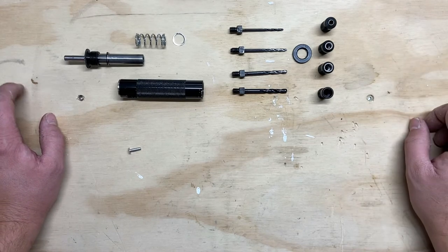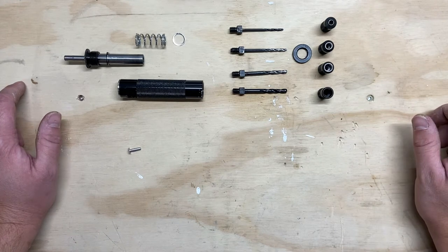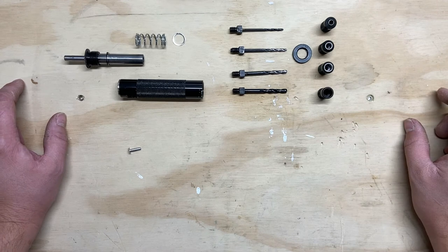What this tool does is it helps prevent damage to rivet holes in the metal around it. The tool will help accurately remove the button heads of the rivets along with blind fasteners as well, by drilling out only the head and not the metal.